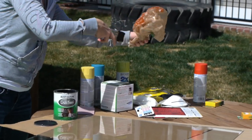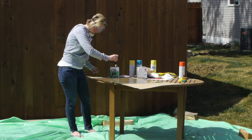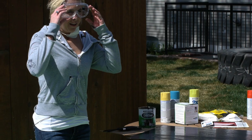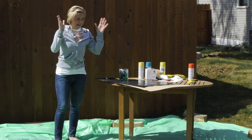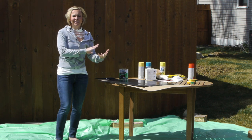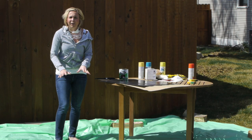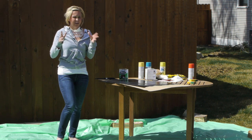Use a good quality synthetic brush, painting in one direction. You'll want to do two coats as well. After you're done with your chalkboard paint, remember to do two layers: do the first one, wait three to six hours, let it dry, then do a second layer and let that dry. After three days you can put this together and start writing on it with chalk. You could put it together before then, but you can't use chalk for three days.